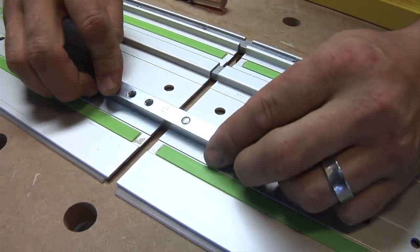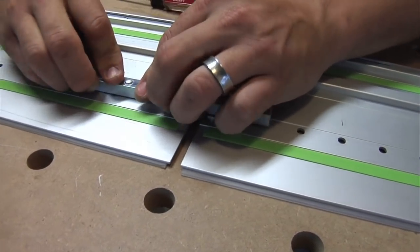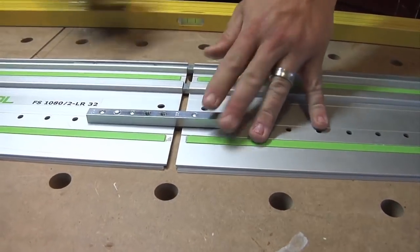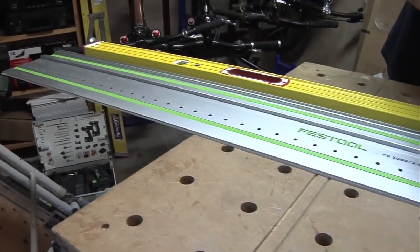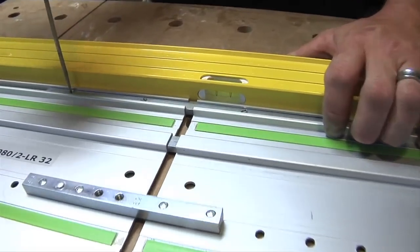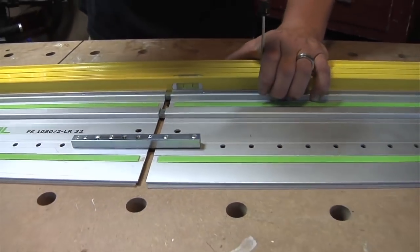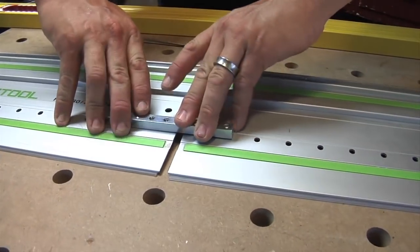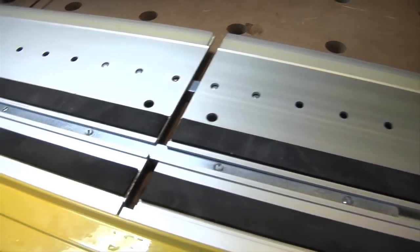We're going to line it up. They're really snug — when you get it, you get it. That's spaced. I'm going to use the six foot level again, holding and making sure it's hitting constantly across this whole rail. Make sure your connectors are equally spaced on the rails. It's fine to have that gap — that gap is totally normal. The rails are going to be spaced perfect for this. I'm going to make sure that's still snapped in there. I'm going to flip it over — you can see it snapped in there. Throw the six foot level back there, making sure there's no little wobbles. Gently tighten these down.